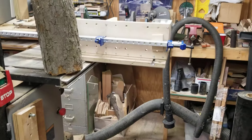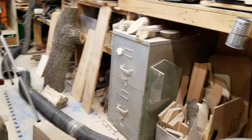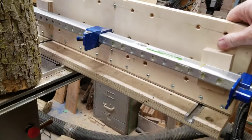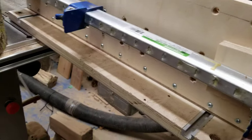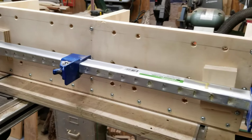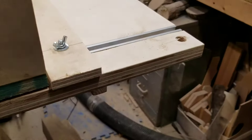On the bottom it's just three-quarter inch plywood for the base. For the rail system I put some track on the bottom. My Craftsman bandsaw has not just a slot but a T-slot, and that's where this comes into play - it grabs the bottom of that T. That T-slot allows me to pull this sled way out and it still grabs on there, so it won't fall out and gives me stability while positioning a log before I start cutting.